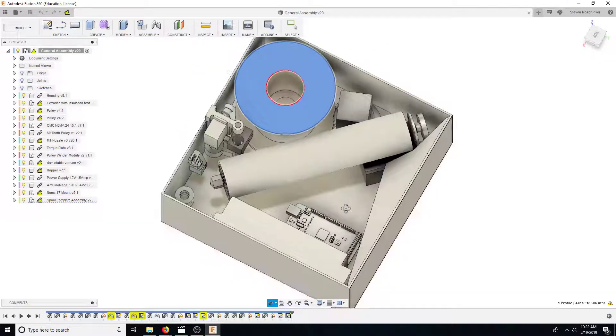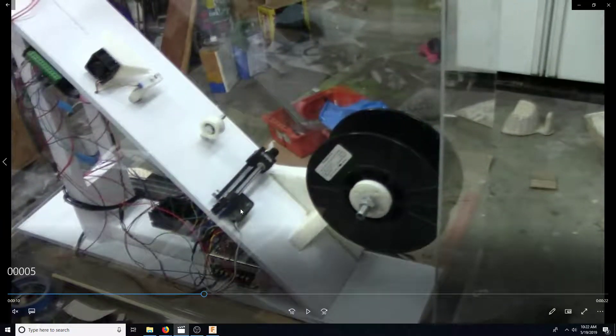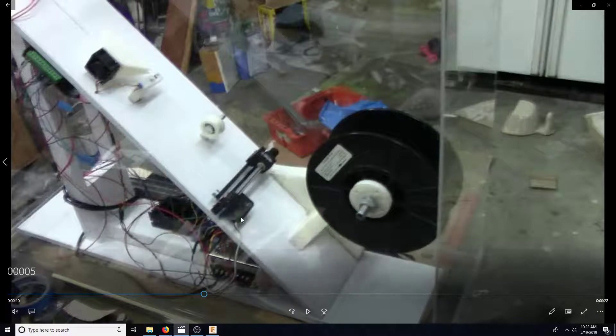Now let's talk a little bit about the winder. The winder is probably going to be the same inside the box, just shorter. Another thing that changed is how many turns this spooler motor has. This is just a regular servo — it said four-turn but it turned out to be four turns one way, four turns the other way, so it's actually an eight-turn. I only need a four-turn, so we lost a lot of resolution there. I ended up buying some replacement two-turn ones.